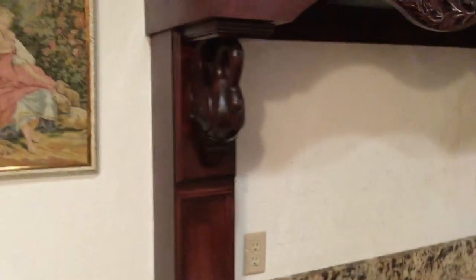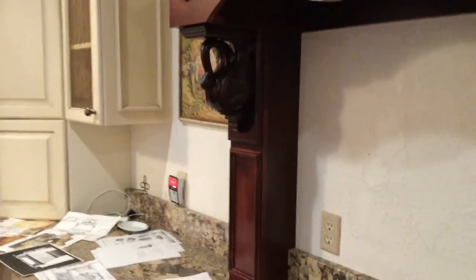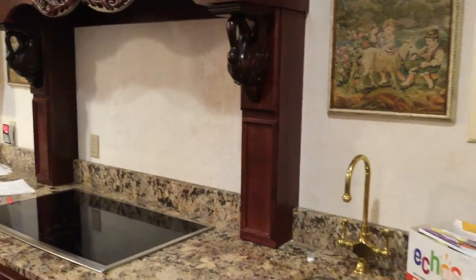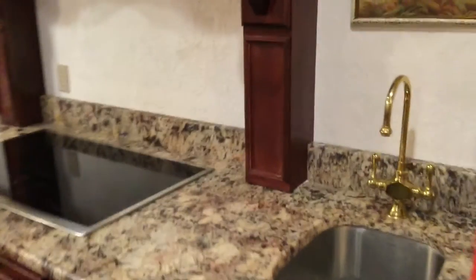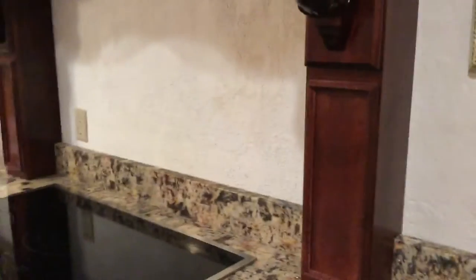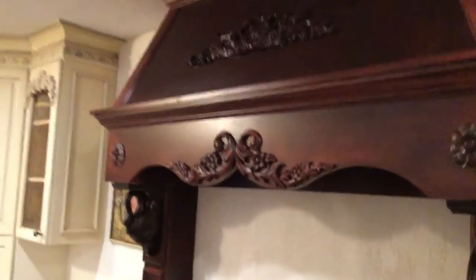The rest of it is basically boxes. The bottom here is a boxed column, and I took the measurements from the corbel. Originally I wanted the box piece on the bottom to come out more into my countertops, and that was the design until I had the countertops installed. After the countertops came in, I decided to have them stick out only a few inches, because I have a little bar sink — actually a vegetable sink — next to the cooktop, and I didn't want that pillar to stick out any further or be too close to the wet areas. So we changed the design and made it stick out just as far as the corbels. Sometimes your designs will change as you see things visually.